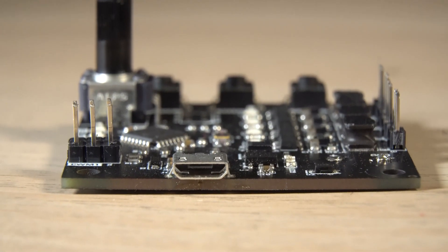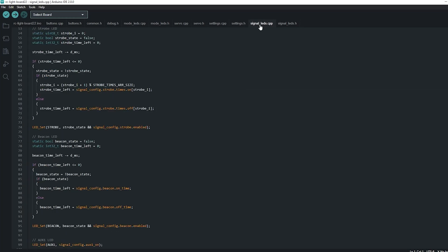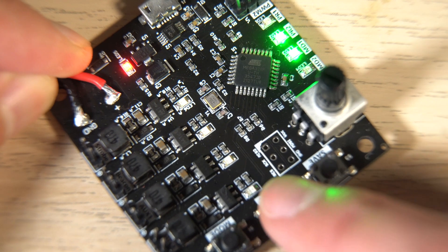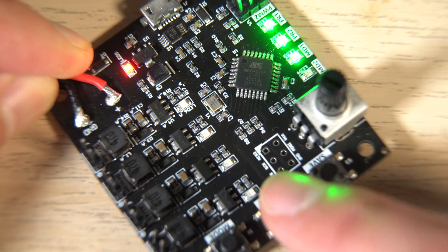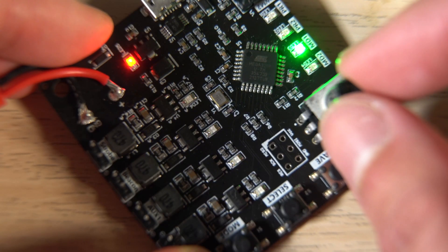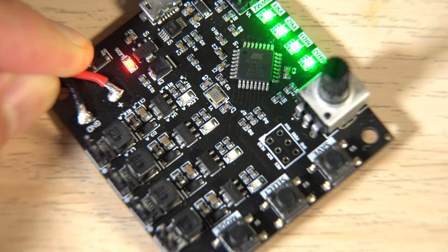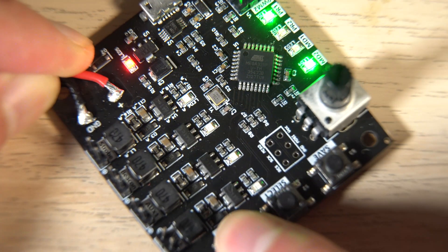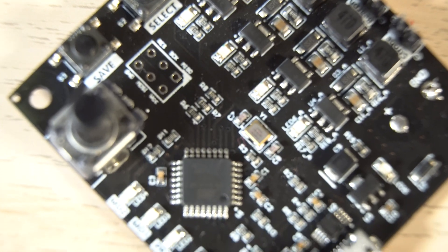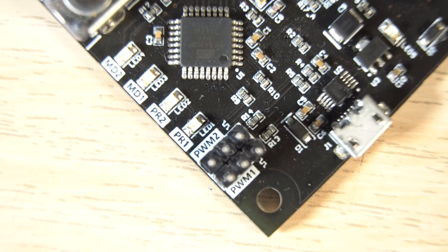The customization is almost without limits. On the flashing patterns you can simulate the strobes of any airplane you like by changing the code, or you can do it right on the board itself with the push buttons and potentiometer to change between three different predefined strobe patterns or change the timing of flashes independently, including the beacon light. You can save these modifications and the next time you power up the board the configuration will be the same. All that can also be changed in the Arduino IDE software so you can program in your own patterns.